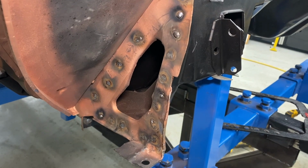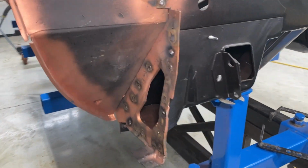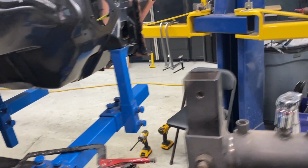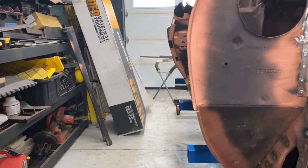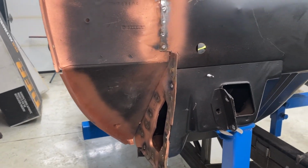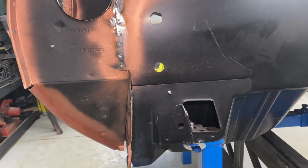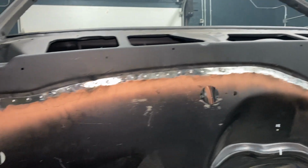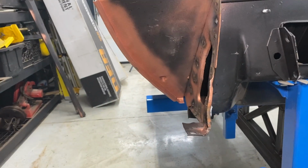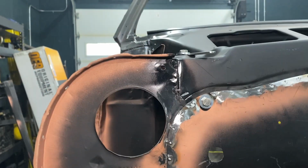So I used the method that John from Vinyl Village Garage and Lewis from First Generation Garage use, where they just drill in with like a 3/8 or a 5/16 drill bit until you're into the second panel and then stop. Then when you're welding it up, you have a nice cone in the second panel to penetrate into. It works really slick. So if I hadn't pre-punched everything and you've got to drill holes to do your plug welds, then that is definitely the way of choice.